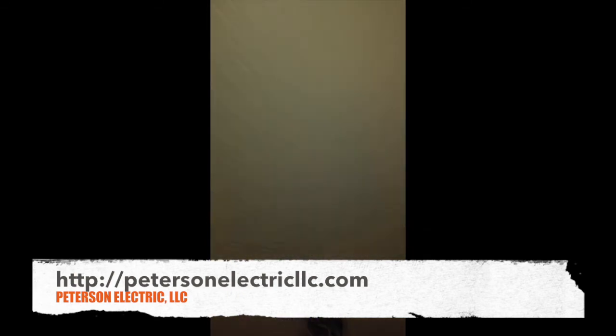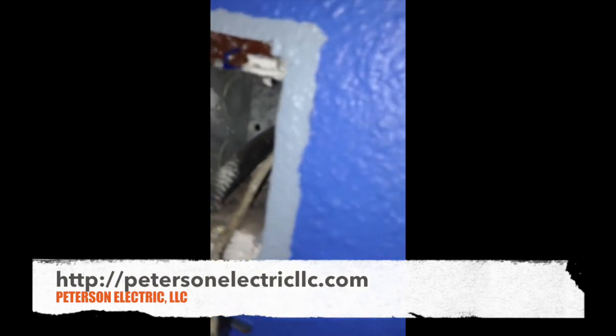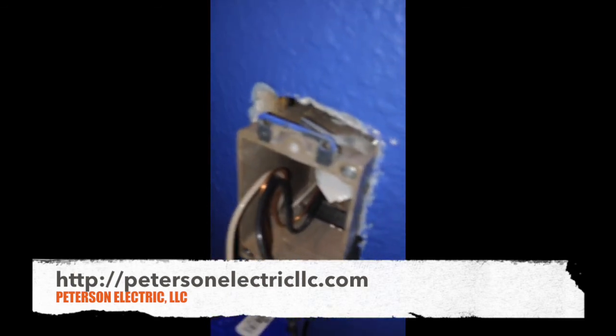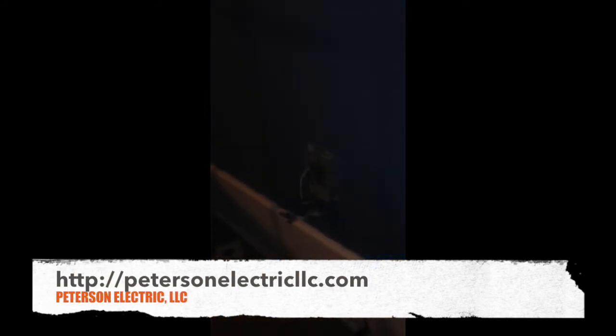I've got proof of five different types of wire, and all different kinds of cut-in boxes. Brand new cut-in box right there, older style cut-in box right there. And then newer cut-in fiberglass — I use those all the time. And then here's an old metallic one with the angled back and square knockout-looking things — that's how you know it's original. Look how that knob and tube is coming in the side. Real safe, huh? The outlet's coming out of the wall — not sure what to do with that yet.